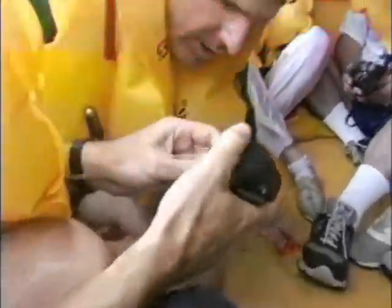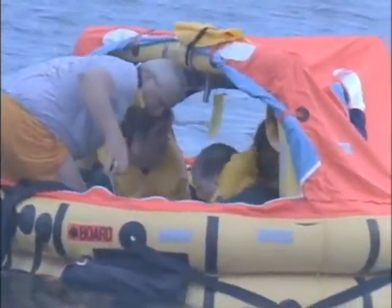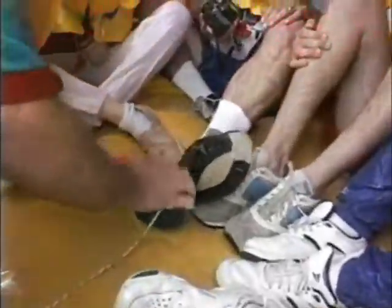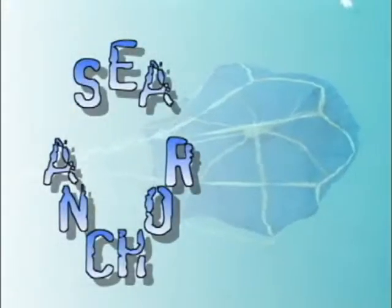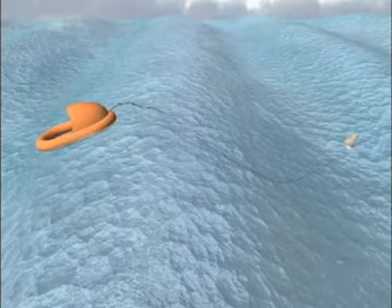Retrieve the hand pump and keep the raft cells fully inflated, as this will help the raft to be more rigid and stable. Dry the raft using the bailing bucket and sponge — if the inside of the raft gets wet with sea water, it will be very uncomfortable for all occupants. Inflate the floor, which will make the raft more rigid and stable as well as providing additional insulation from cooler waters. Check the sea anchor for proper release. A sea anchor will reduce drift and increase stability of the raft. The length of line should be adjusted according to sea conditions — usually it is best to keep the sea anchor line long, so that when the raft is at the crest of a wave, the sea anchor will remain in the trough.